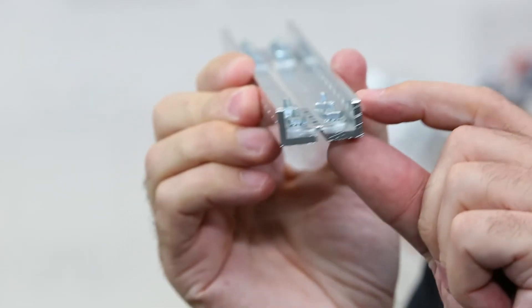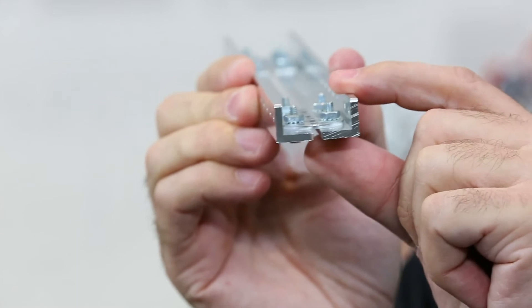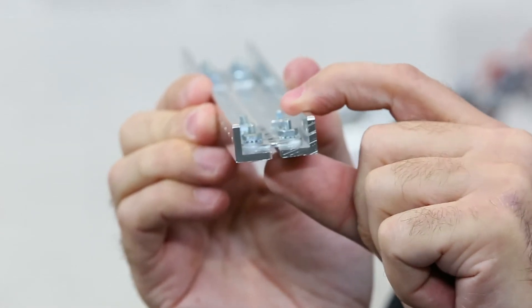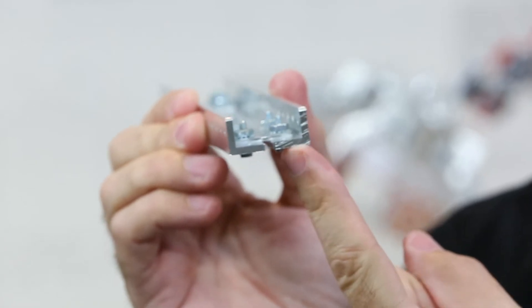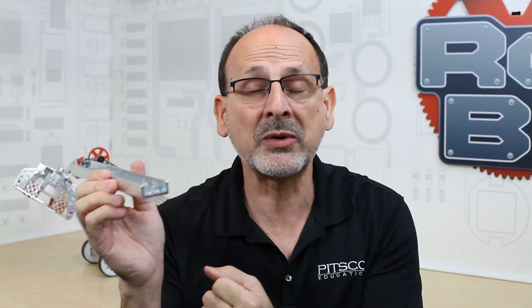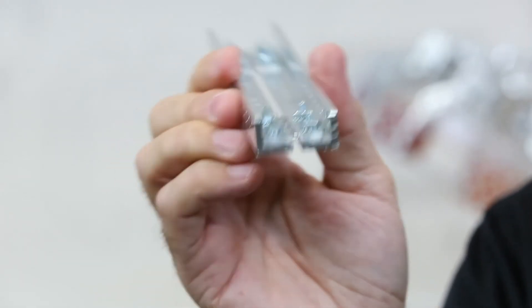The other thing you need to think about is the thickness. Because they are three millimeters thick, the shorter socket head cap screws might not be long enough. You may need to use the half-inch socket head cap screw in order to get enough length to go through and securely contact into the cap nut. The purpose of this is a very robust and strong structure, so you want to make sure you have enough thread engagement for the socket head cap screws to really take advantage of that.